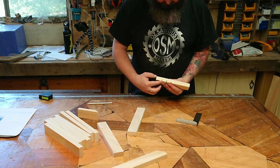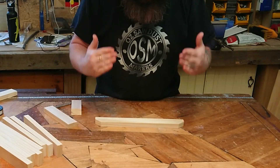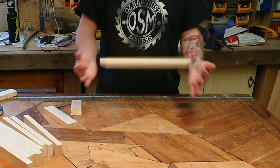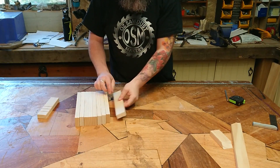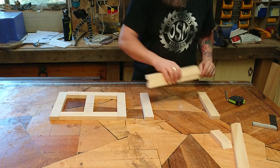I've cut those grooves using my miter saw, but there's a million different ways that you could do it. I've then cut 45-degree corners off the book rest. Now I'm laying out my frames and setting aside the pieces that will actually need pocket holes.